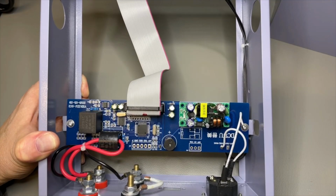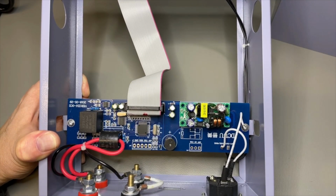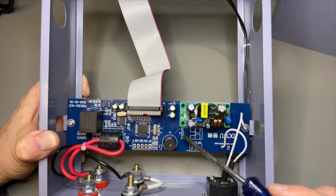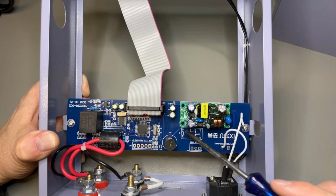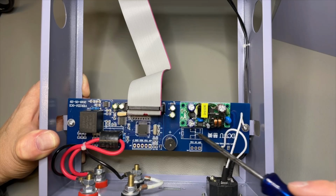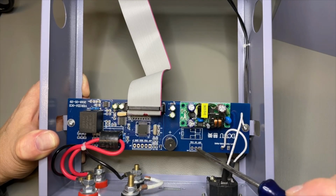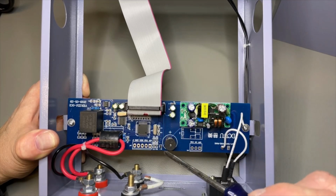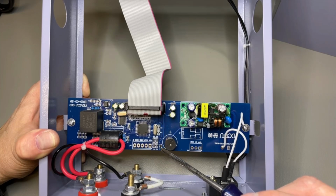Yeah, and as I said, there is this alarm option, but to me it looks like here you can put, this will probably be a diode because this is your relay, and all those wires in the bottom just go here. And here is your output of the relay. But if I follow this line, just ignore the buzzer, you have here this little transistor.